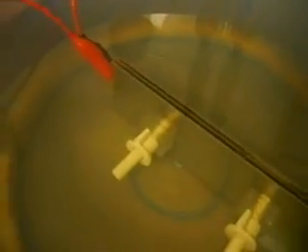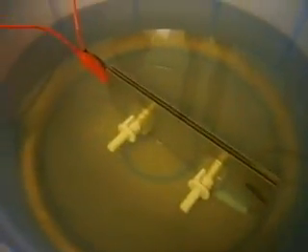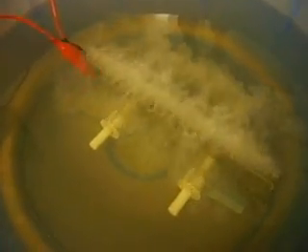So this is the three-plate cell — I've just added more electrolyte. It's actually running at 9 amps, mainly because I've put so much electrolyte into this water. It's very obvious to me now that the larger the gap between your plates and the less total surface area you're using, the more electrolyte you need. That's true whether you've got neutral plates or not, but it's even more so for neutral plates because there's double the gap between positive and negative.